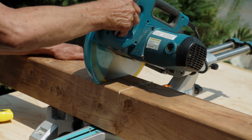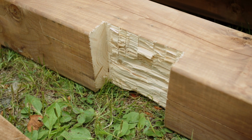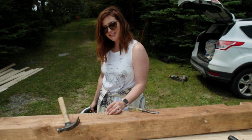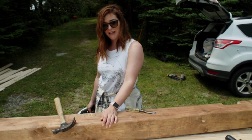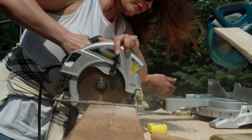Step 1 of the plans requires us to put the legs of the canoe rack together. In this step, we need to notch out a spot for our canoe braces. To create a notch in your board, you want to cut 1.5 inches deep into the leg of your canoe rack. Then you run the skill saw across every 1/2 inch.